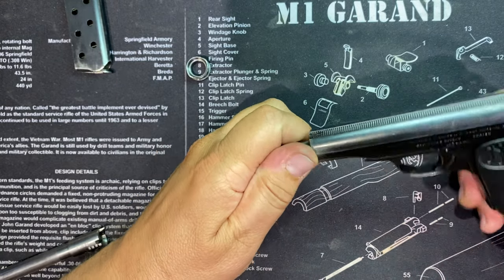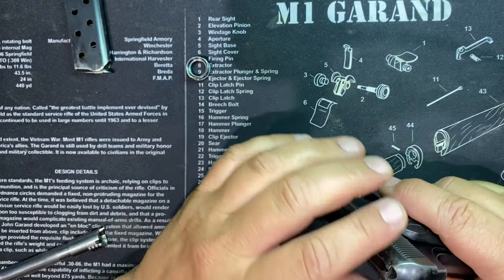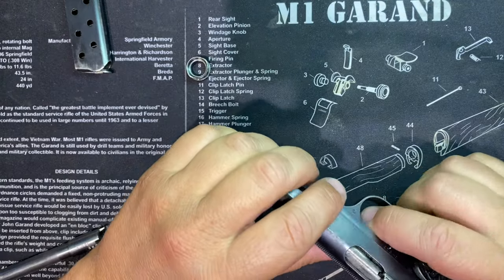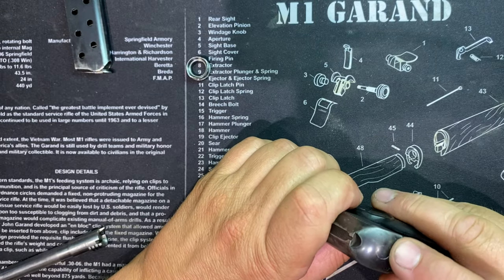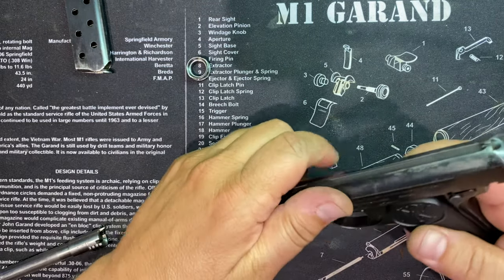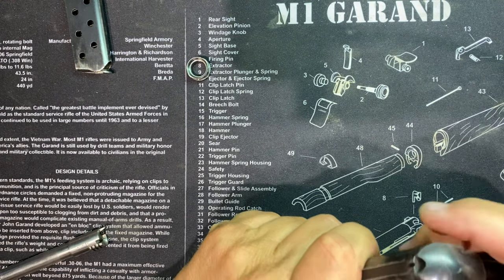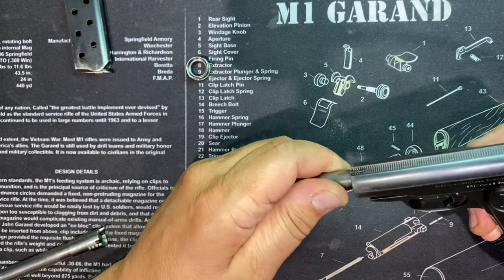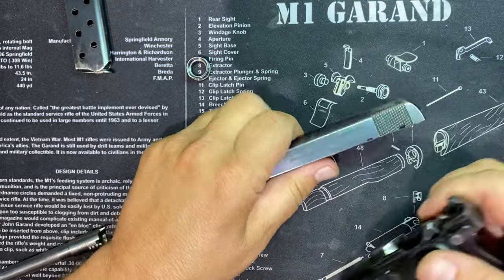Stop turning that too far. It just goes to that spot and that's it. See, look at that. Oh, it's so almost there. I bet you that's good enough. That would be good enough to work. But look, it's still not perfect. See that? I could feel that it's still... If anything, it was proud the other way. Not proud this way, it was proud a little bit further, too far in with the 32 caliber. It could be that the 32 caliber barrel is worn a little bit. I would settle for just exactly, perfectly in battery as far as what it shows in the back here.